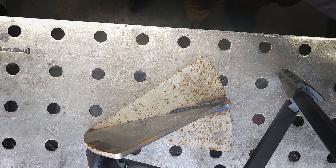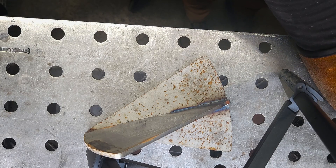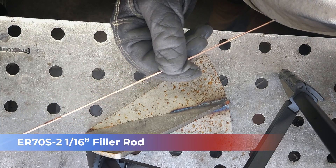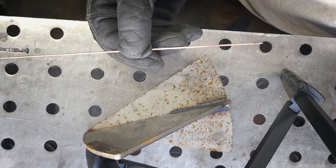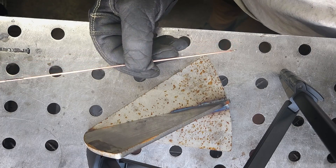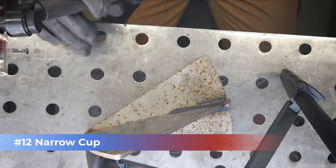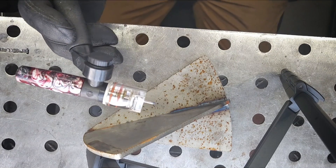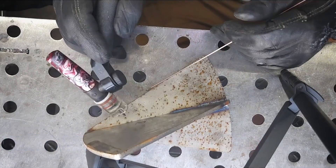First, I just want to start with the plate set up as a T-joint. I did run a test bead on it — one with wire and without wire. I'm using 70S-2 wire, and while that does have some deoxidizing scavengers in it, with a fusion weld alone we don't get that help from our filler material, and that can definitely cause more issues such as porosity, undercut, or the puddle might just not flow well. For our torch setup, I'm using a number 12 narrow cup — I really like these for inside corners so I don't have to have a ton of stick out. For our tungsten, I'm using a 3/32-sized CK Worldwide laser tungsten.